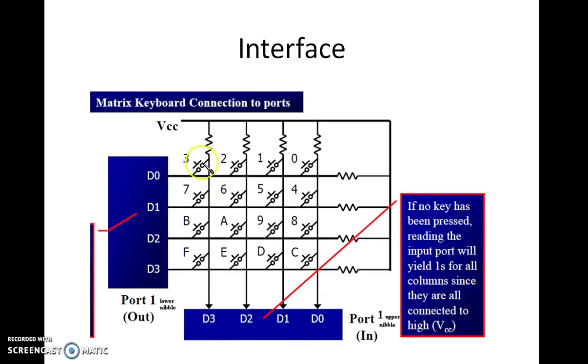Because they are directly connected to VCC. And if some key is pressed and at the same time some 0 is written to this port, this VCC will be dropped and the ground will be connected to this reading point. So if the key is pressed and at the same time 0 is written, then the measurement value will be logic 0. This is the basic of keypad interfacing.